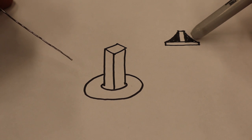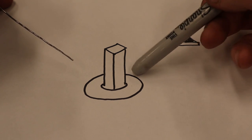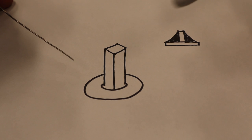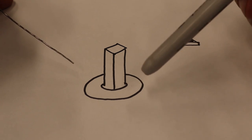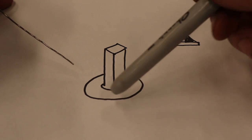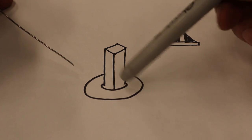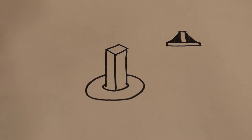What you're looking for is a nice little pyramid shape all the way around where it's attached and flowed — as opposed to a big round blob or a partial fill. The only other thing to know about soldering is you don't want the two pieces moving while it's cooling and hardening. If that happens, instead of a shiny volcano look, you'll get a dull gray look — that's called a cold solder joint, and that usually means you're going to have electrical problems. So let's use that info and start soldering up our Teensy.